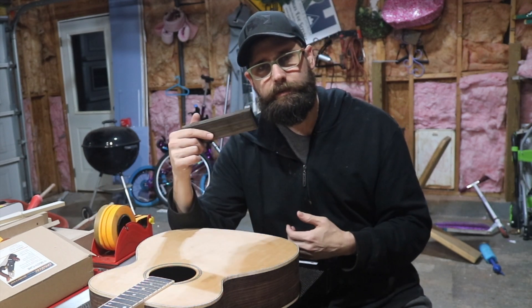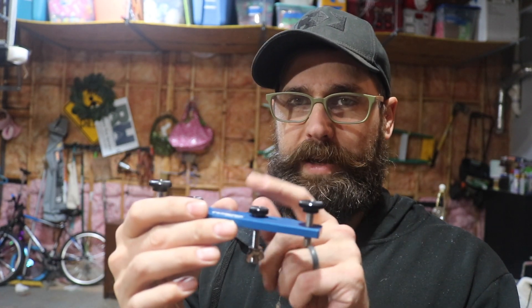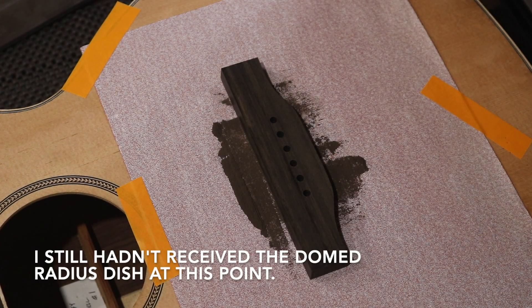As a side note, I also ordered this bridge clamp from LMI at the same time. I've seen Gabby use something like this on her YouTube channel. What I like about this one is that I'll be able to clamp it with nothing in the way so I can clean up glue squeeze-out. I've already got feedback from people on Instagram saying glue could get on the screws and make them difficult to remove, so I'm going to put some paste wax on those screws before I install them.